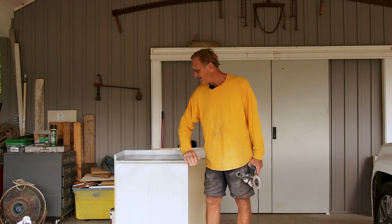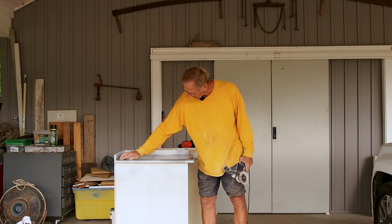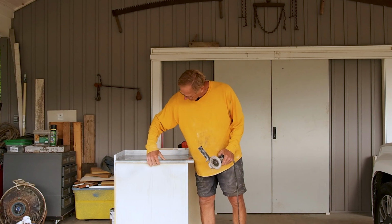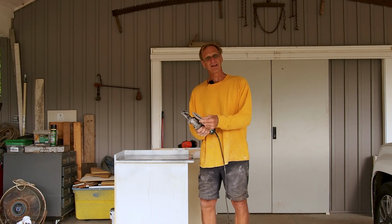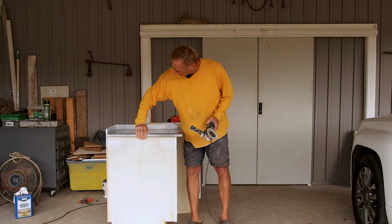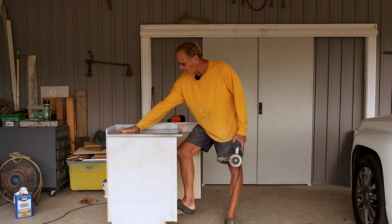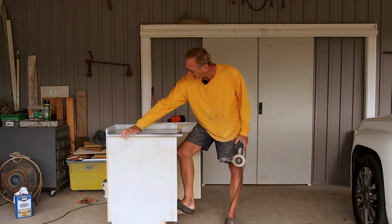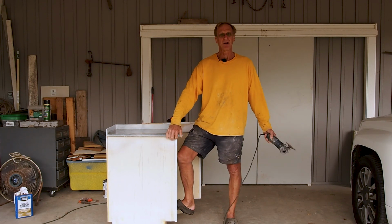It's been several days now since I poured the epoxy. It's nice and hard. There are the drips underneath the edge here where the epoxy flowed over, carried the color pattern over. These drips I'll cut off with an angle grinder with a 40 grit sanding flat pad wheel on it. So I'll use the angle grinder to get the shape underneath, how I want it, and get all these drips off. I'll come back over with the orbital sander, start with 320 grit sandpaper and work my way up just to make sure the tops are super smooth. Paint these cabinets, get them ready to go upstairs.